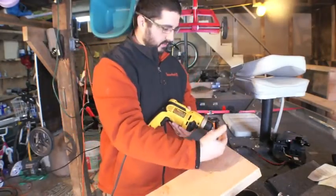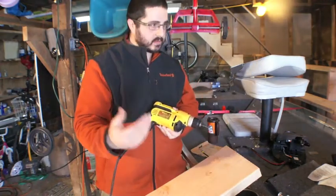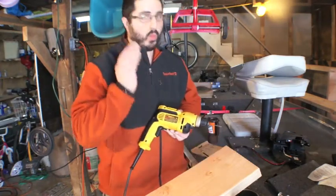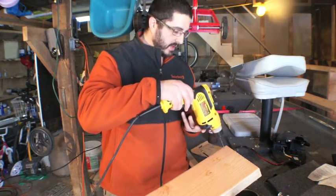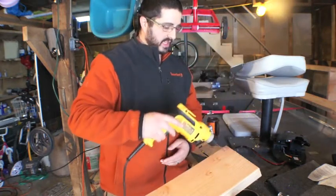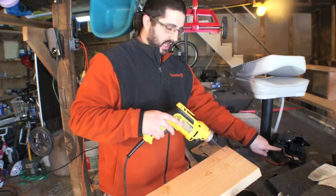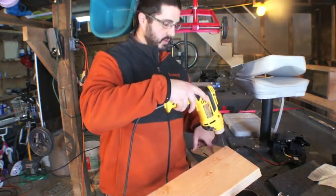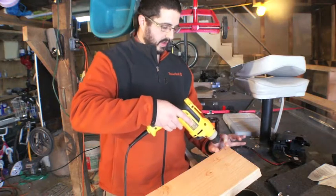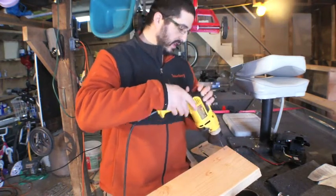I'm going to make three holes: one on the top, one on the bottom, one in the middle. I'm not going to bother measuring them out — this isn't rocket science. These boxes aren't works of art; they're just boxes. You're throwing dirt in them, so they don't have to be perfect. The one thing I will say is try to go through the wood at an even angle — don't go in crooked in any direction. Because if you do, your screw's going to go into the next piece of wood and start coming out the side. We want it to go straight through into the next piece of wood. I'm just eyeballing it — it's going to sit in there about like that, so we want to aim for right around here. Drill the holes, nice and even. Bang, bang, bang. And we'll see where we end up.